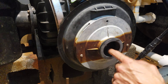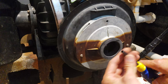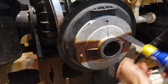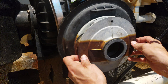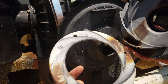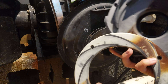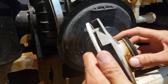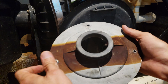This shroud around the impeller is held on by two screws on either side here. It just takes a quarter inch socket style hex to remove those, or a flat head screwdriver. This housing is two pieces - try to keep them together. There's only one way of assembling them because there's a hole up here that mates into a pin up here, so that's the only way it's going to go together. Nonetheless, try to keep everything together with the screws.